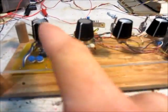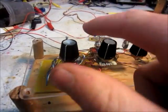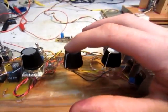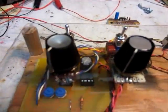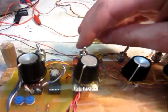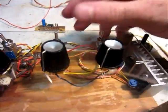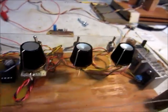Okay, so this one here has four knobs — I upgraded it. We have the duty cycle, this is the frequency, this is motor number one speed control which is this motor here, and this is motor two speed control which spins it this way. Those are the knobs. And then we have the switches up here: this is the power switch, this is the frequency switch — it changes the capacitor value connected to the oscillator circuit. And then these are on-off switches for the motors, because when it's down at the low end it's not quite all the way off, so it'll still spin some.